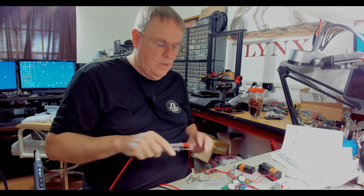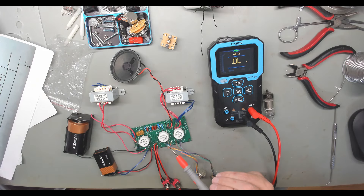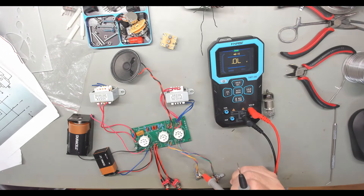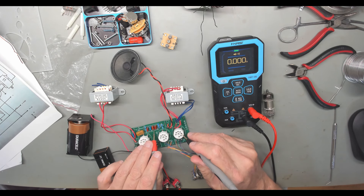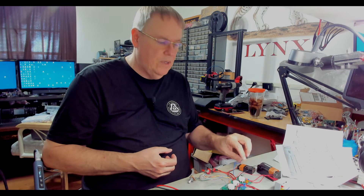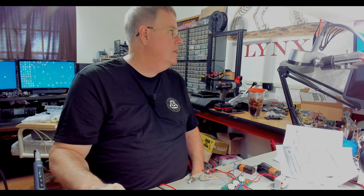I've decided to go ahead and figure out one of these capacitors. There's one that feeds the audio into the amp stage — I want to find where that's at. Going from pin 3, I found that capacitor. I'm going to grab a capacitor on my signal generator to protect it from any DC, inject audio, put the tube in, and see if we can hear audio coming out. That'll tell us whether the second stage of audio amplification is working.